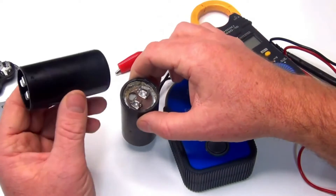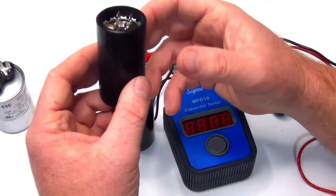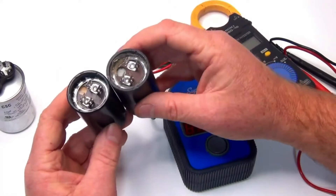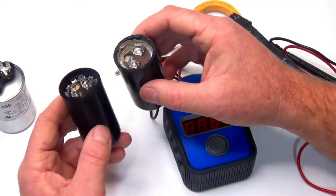It's not very often you see it, but where it sits on top, on the side, or in the back of the pump — before you even open it up you'll see oil coming out. If you touch it and it's really oily, and you find your pump's tripping a breaker, do these tests. But if you visually see the damage, just replace it — you don't really have to test it, you know it's going to fail or has failed.